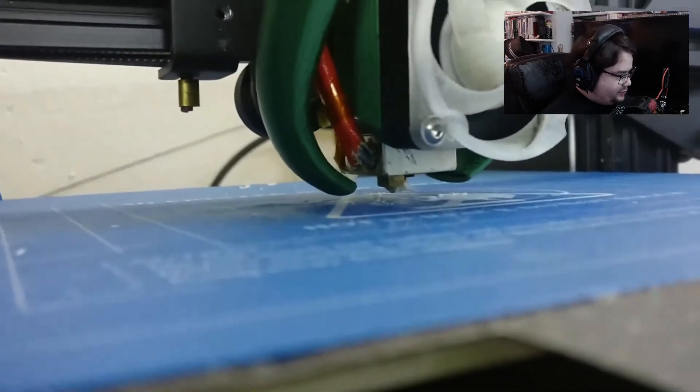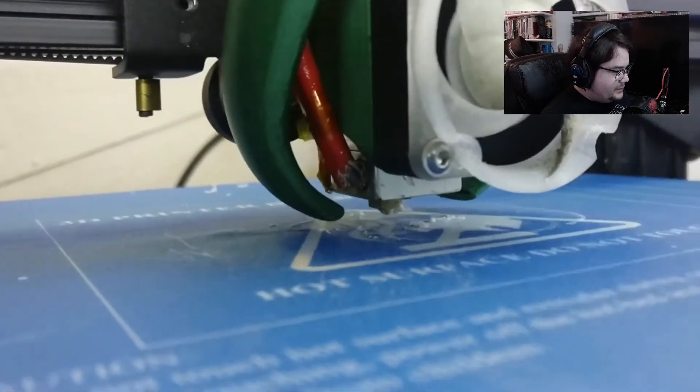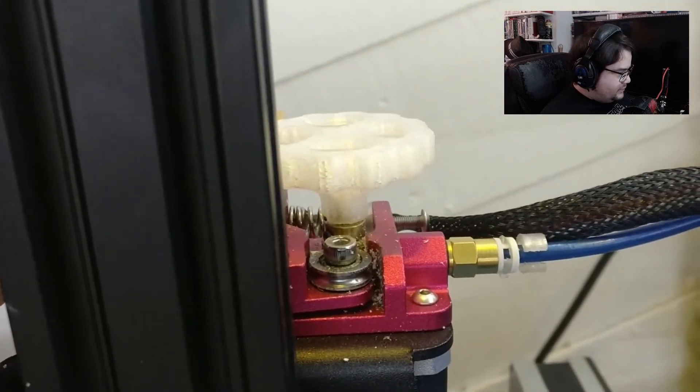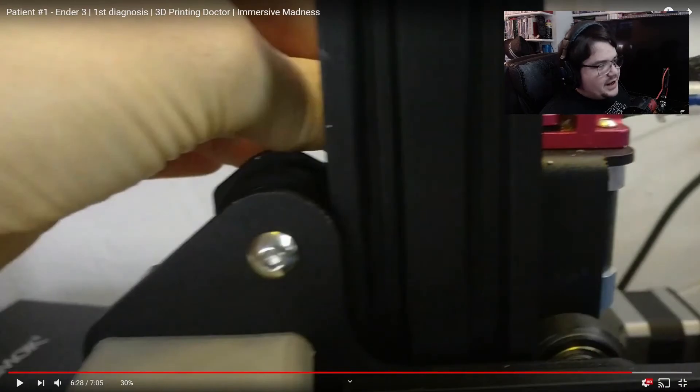It looks to me like you've got a bit of a problem. It's just completely stopped. So what's causing that? Well, you can still see the extruder is turning — that explains all the chips of plastic around there. What it's doing is trying to shove the filament in, it's just met an obstruction, whatever that is. And it's now just grinding the filament. If you look at the filament at that point, it'll have a shaped divot out of the side of it. Not good.